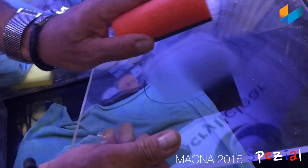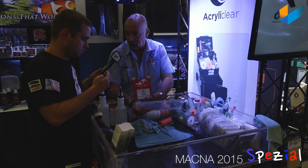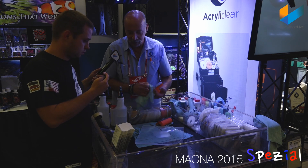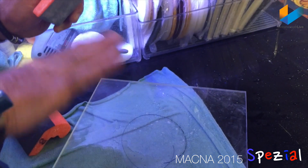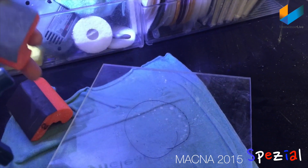So with 800 we went across this way. Now I'm going to turn it and go across what I did, so you take an even layer, and we're going to use the 1200 paper. With the first step, you sand until it's gone. With this step, if you listen, you can hear the paper, and it gets quiet when you're done.